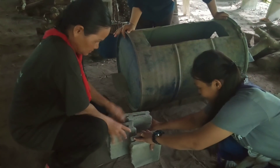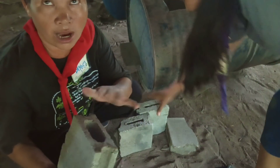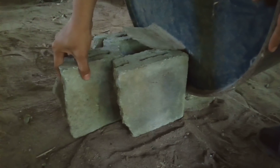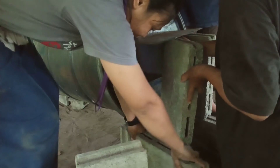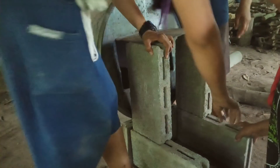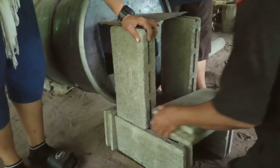When the preparation for the drum is finished, we set up the drum using 15 cement blocks. We put the small hole of the block facing up so we don't use too much sand or mud to cover it later. This end will be the chimney, connected from the small hole. The front end is where we start the fire. We use about 15 cement blocks to create a tunnel for the kiln, because we want to start the fire outside, at least half a meter to one meter away from the drums.